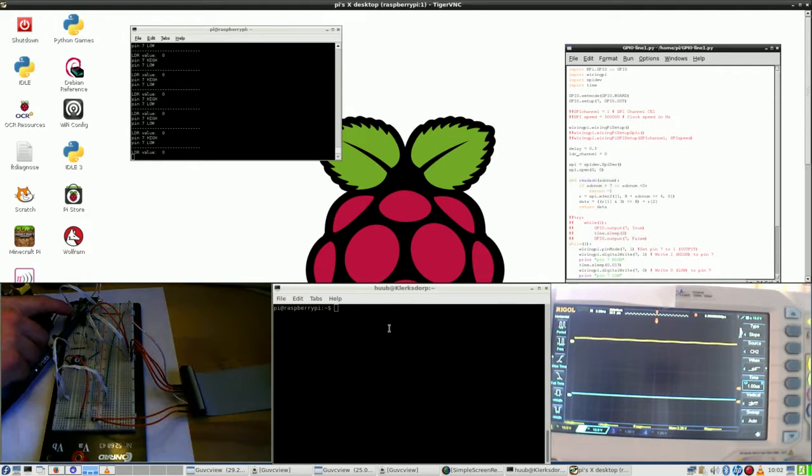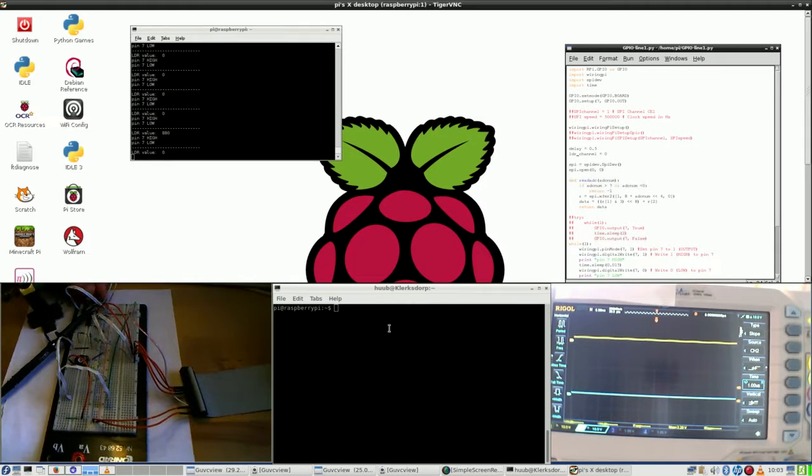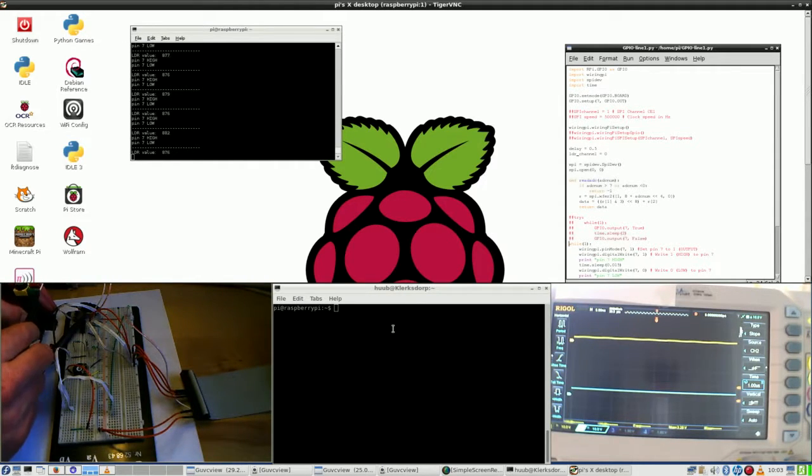As you can see, there is something to measure, because when I press the button next to this LDR, and watch the yellow line, you can actually see that there is a value. When I press, it gets 0 because I ground it, and when I release it, it measures. So what about the second one? Now I notice that this one has come off, so let me hook up again. Same for this one, hook up to the ground and to this one, and you clearly see that it gets a value reading.